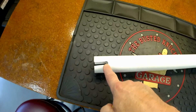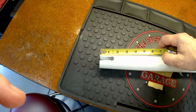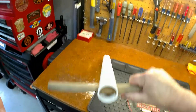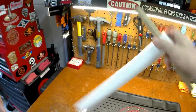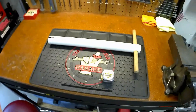The slot is roughly about a quarter inch wide, which allows it to slide over the wings of the shutoff valve. Just a slightly-bigger-than-quarter-inch round hole, and about an inch and a half tall at the top of that slot. Along with the dowel pins, it's pretty cool and easy — slide it on, give it a turn left or right depending on how you're situated. Lots of leverage; you don't have to hurt your back, your wrists, or anything else.